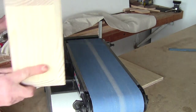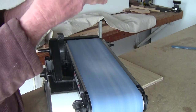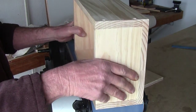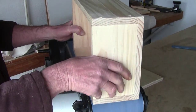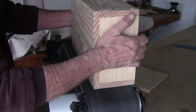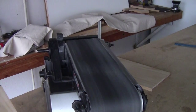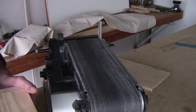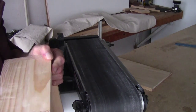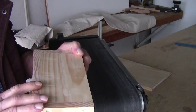Set up with a 120 - time to sand all flat surfaces with 120, then work through the grits. Done - did the lid and the box with the 320. From this point we're going to do our finish sanding, finishing the lid and the box.